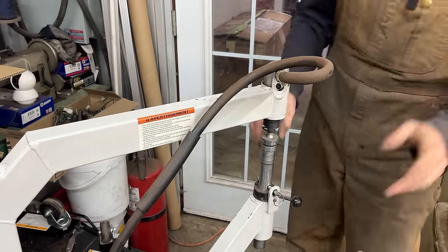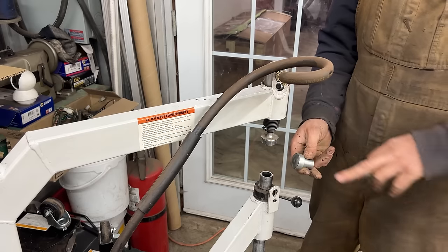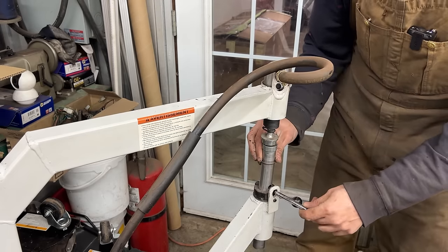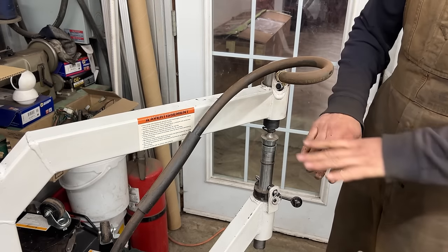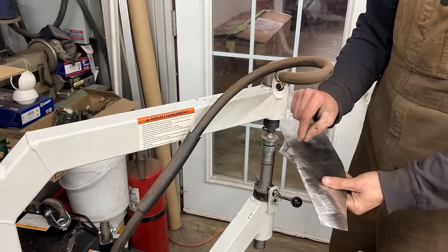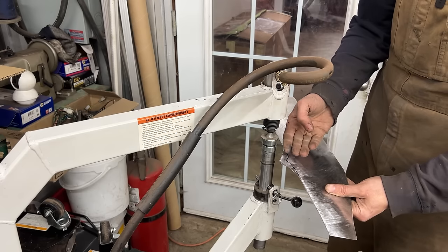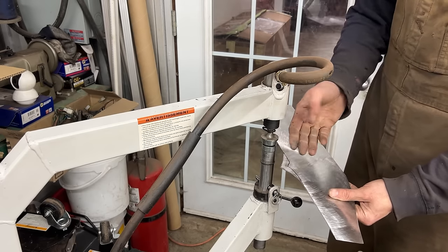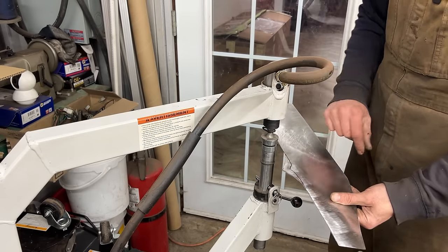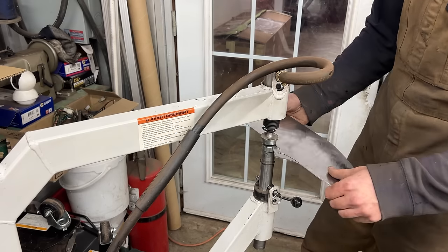So for those of you who don't know, the planishing hammer has a die underneath with a crown and another die on top, which is flat. And depending on the shape of the bottom crown, you create shapes. You stretch one little dot at a time, but since you're making every single dot bigger, now all of a sudden this volume has nowhere to go but to go three-dimensional, you know, to go up, because you have more, not more volume, but more surface. So let me show you.